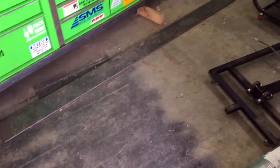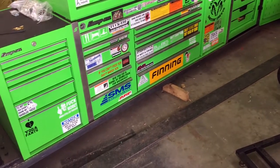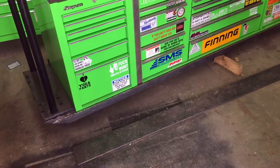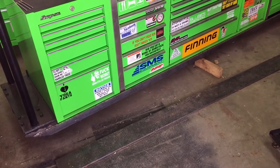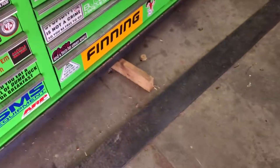It's a reinforcement plate for the cart. So I got a custom cart made, and they didn't listen to me when I told them how heavy my toolbox was. And they didn't build it out of thick enough metal. And now without that support block in there, it warps. So I already went through and welded one on the front, which helps the front quite a bit. But the back, even with how thick the back is, 6-inch rolled back, 1/4-inch steel plate, it still warps.